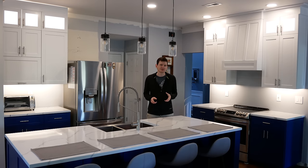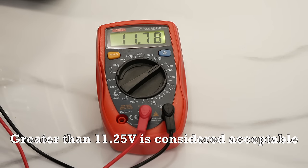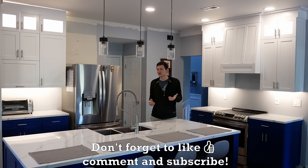The other major design consideration is voltage drop. The voltage will gradually decrease along the length of the wires, so the longer the wire or light strip run, the lower the voltage will be. This is potentially an issue when you have a long wire run or a long strip of LED lighting, as the lighting may appear dimmer farther away from the driver compared to lighting that is closer. The total voltage drop is a function of wire length, wire thickness, and total watts used by the lighting system. I've put a link to a voltage drop calculator in the video description. Before installing, I calculated that my planned wiring should result in an acceptable voltage drop, and I confirmed this with a multimeter at the lights furthest from the driver after install. If you want to design and install your own cabinet lighting, all the resources, tools, and materials are linked in the video description. Until next time, go build yourself — and let there be light!